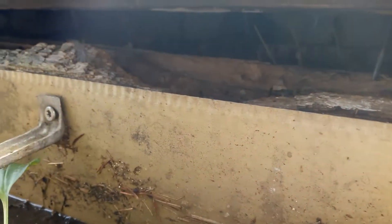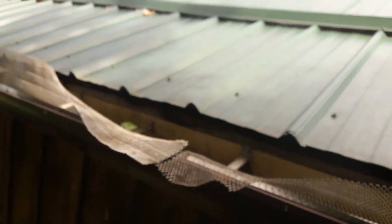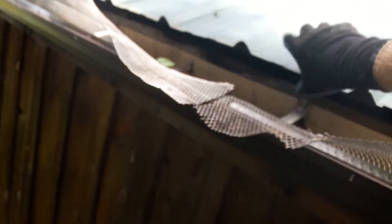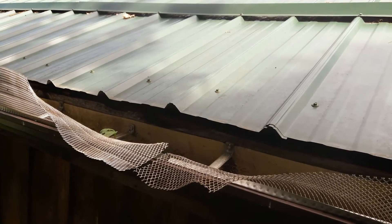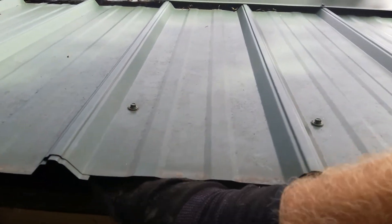See where the wood's chewed up — you might notice something's missing. So what do we have missing along here? This is a steel roof that lacks drip edge. All steel roofs are supposed to have a drip edge that slips up under the roofing and then drops down in front of the fascia board. But they did not do that here — instead they left a big gap. Right here there's no chewing damage, but I can put my hand in.